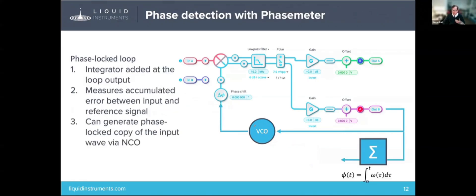This is useful because we can now introduce the concept of a phase meter. The Moku instrument, which I'll show you during the live demo, has a phase meter. It's based on a phase-locked loop — you input a frequency at A and the VCO locks on to that frequency. An integrator is also attached to the output, so if there's a phase drift or a difference between the input and the reference frequency, it will start to accumulate at the integrator output. Because you're integrating, you are measuring the full unwrapped phase information — you're not using a trig identity to determine your phase anymore.